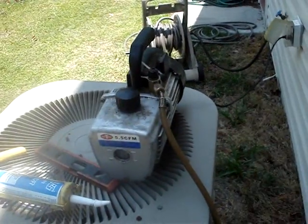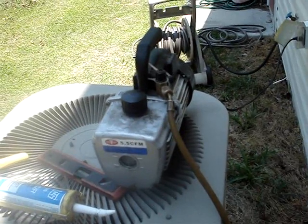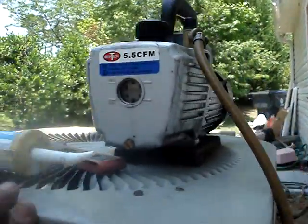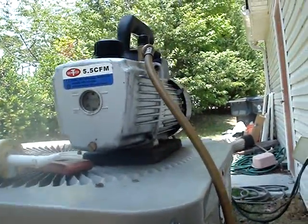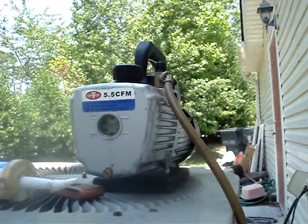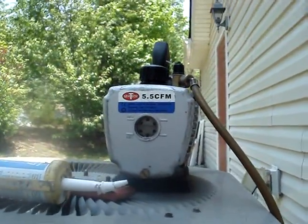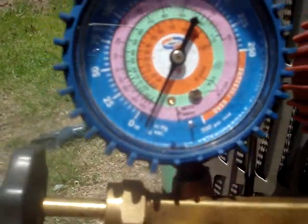This stage is called pulling a vacuum. After the nitrogen test checks out — we had 250 pounds on for 30 minutes — I move on to the vacuum pump. The vacuum pump takes all the moisture out of the line by lowering the pressure inside so the water evaporates. If you lower the atmospheric pressure enough, water will evaporate at a lower temperature — that's the method behind it. This is a five-and-a-half CFM generic JB Tech pump; it's been a good one. You can see it's pulling into the negative, below zero on the PSIG.